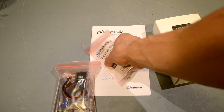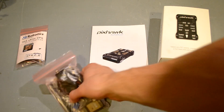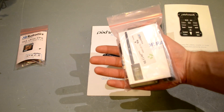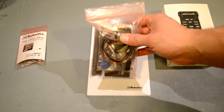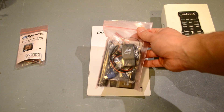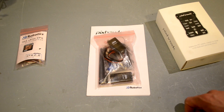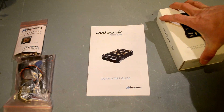I purchased these separately. This module is the upgraded u-blox GPS. These modules are the 3D Robotics 915 MHz telemetry kit. The reason I'm using 915 for telemetry is because I'm using 433 for control. I might get a little noise floor interference from cell phones, but I'll likely be able to filter most of that out. There are also bi-directional amps you can get for this.